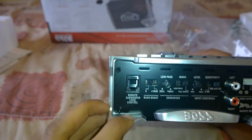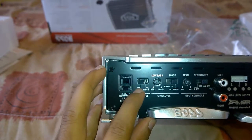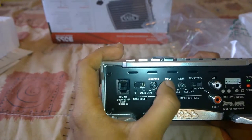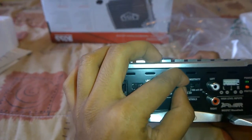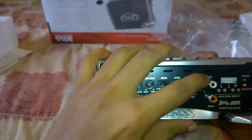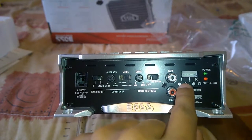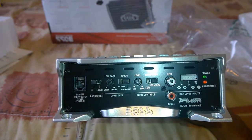On the side we have the port for the bass volume control knob, the bass boost switch, the crossover frequency control where you can adjust the frequency to fine tune the sound output, the low pass and high pass filter switch to adjust the frequency sensitivity of the amplifier, the amp gain control knob, the input voltage sensitivity switch, the left and right channel low voltage input where you connect the preamp outputs of the radio, and finally the high voltage input where you can connect the speaker wires to the amplifier directly.